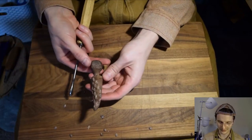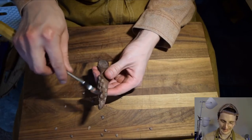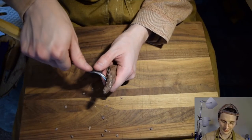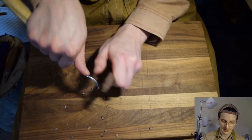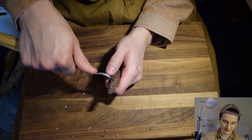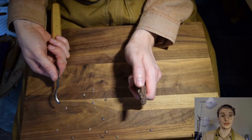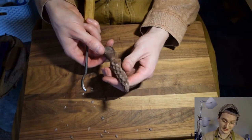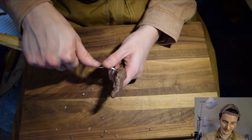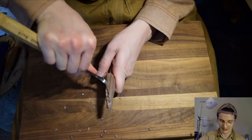Yeah, there's where that little knot was. Okay. Got around that. Yeah, you can even see little patchy, rough spots where the wood tore instead of cut correctly. And you can go back at them this way. I'm going to go back at them with the gouge here like this. You could even leave them, because as soon as you oil it, it kind of covers that stuff up. If they're blatant, you want to go back and fix them, though. At least I do.